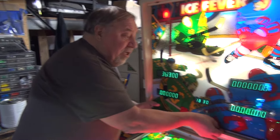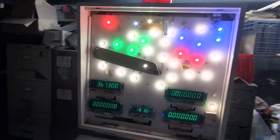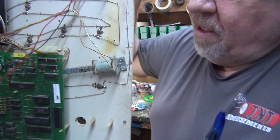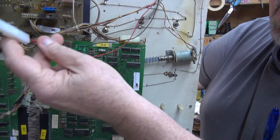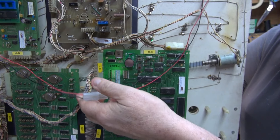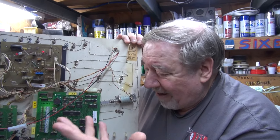It's something you can easily do — I'm going to show you how we did it. Here's the animation mechanism — it's very simple. One coil fires the ball up, and that's what moves it. All we did is tie in a wire here. We put a connector in so if they ever had to take it off, they could unplug it and keep it together. That light blinks when this blinks. It doesn't hurt the transistor because they're LEDs, not light bulbs — they're about the same voltage.